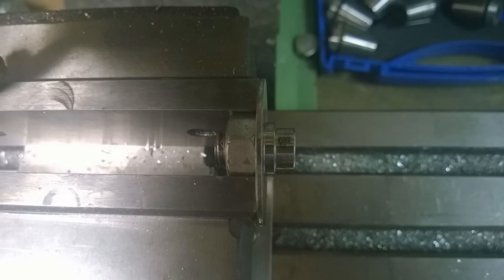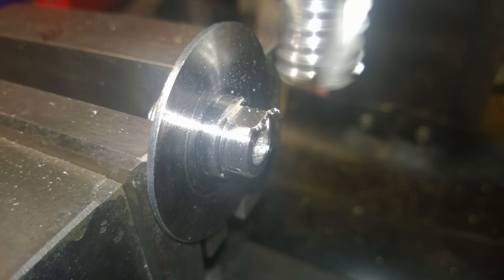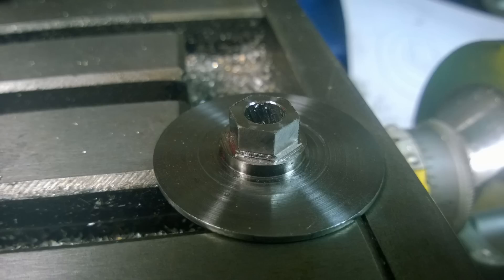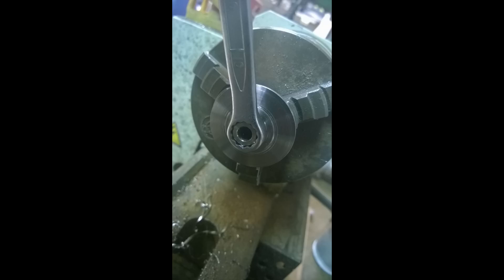Keeping it all locked, you can see the end of the bolt and most of the thread are now gone — the thread I actually want is inside the nut. Without removing any of it, I take it straight over to the milling machine. Because I have the nut it's like a collet, where I can use the flat of the washer as my end stop and the nut flats as reference surfaces. With that I go around with an end mill and start nibbling a hex into it — one flank at a time — to the dimension I want, moving all the way around. I end up with a nice hex, the shouldered section, and I just clean up with a file and sandpaper in the lathe, then use a 10mm spanner to undo it from the chuck.